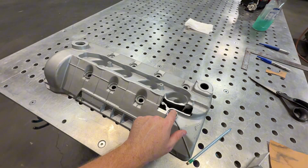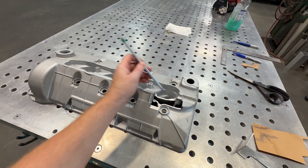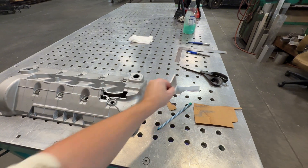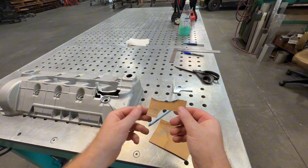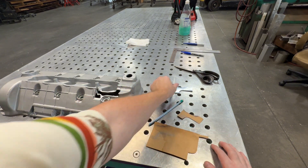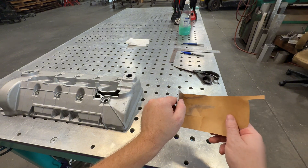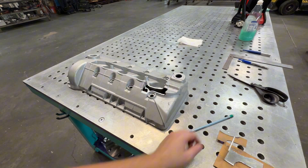I don't want to cover up this circle with the weld, so I can't put the piece of metal out to the edge — I want it right on the inside. I already made my little template, but I thought about the angle afterwards with that piece going up, so I might have to modify it. If I cut an eighth inch off this side it would shift it over, but that messes with my angle. This one will get me pretty close, or I can cut it out, trace it, and round that out a little more.